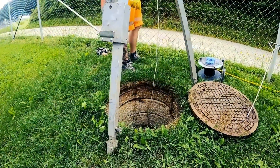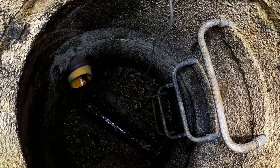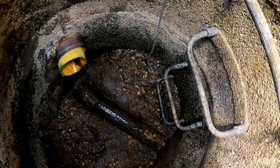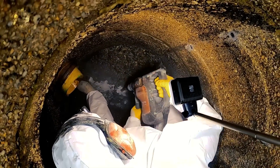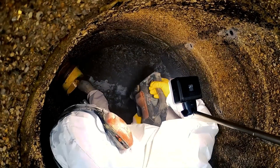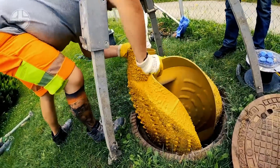Experts' handwork produces the Pretl Flex Liner from chemical-resistant polyurea. Before inserting the ready Flex Liner, a few centimeters of the bottom are chiseled away to create space for rehabilitating components. Next, the Flex Liner is inserted in a single piece and the inlets are sealed.